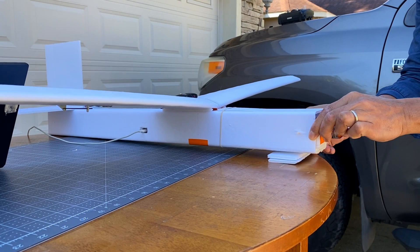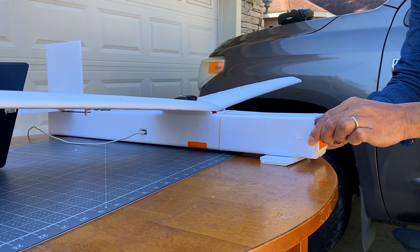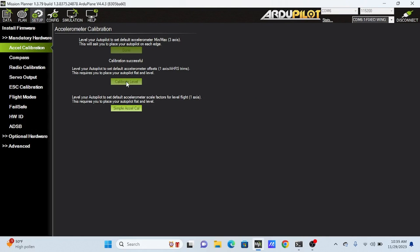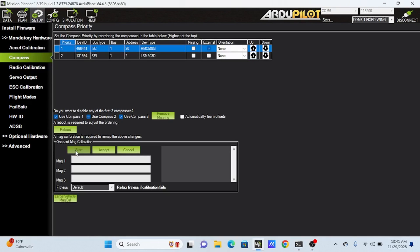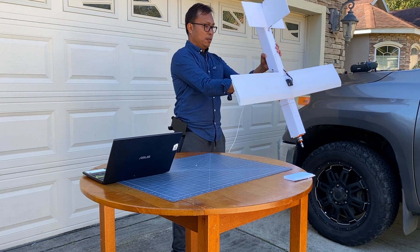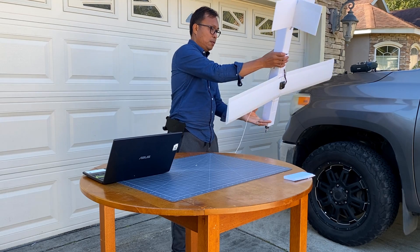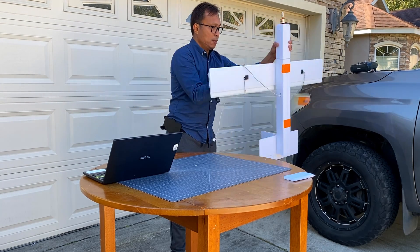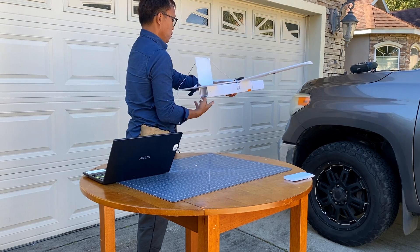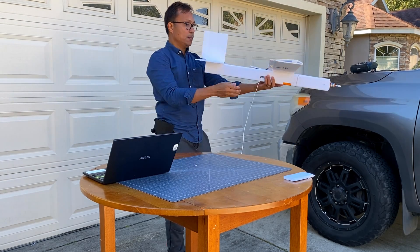For calibrate level, I added a few degrees nose up as recommended, as this will be the actual position the autopilot will hold the aircraft during flight in assisted modes. Compass calibration is to face north and rotate the aircraft on its pitch, and facing west, rotate the aircraft on its side. Repeat until compass calibration is successful.